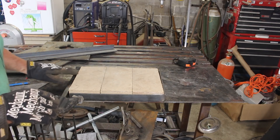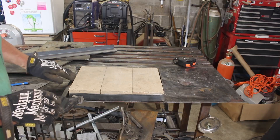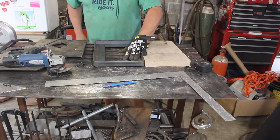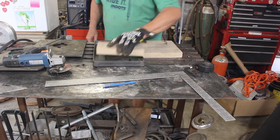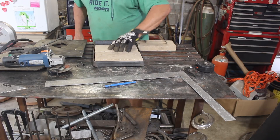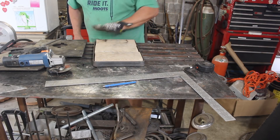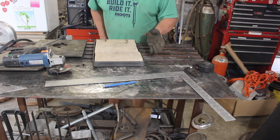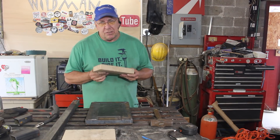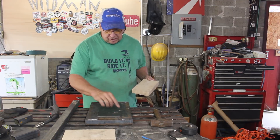There's my floor. I'm going to make a front for it and tack it together, and then we'll put the legs on it and continue the build. Here's the frame for my floor and these bricks will make that floor. I think the next thing I'm going to do is just put legs on this. I don't trust the fire brick to have any strength at all, so I want to make sure there's a complete floor underneath it.